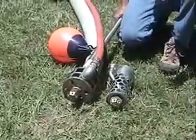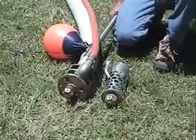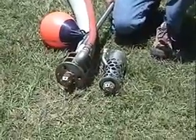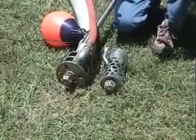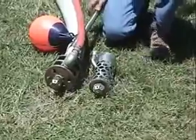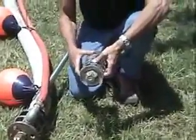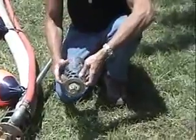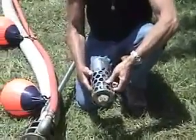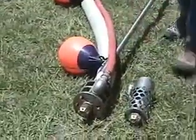And if it's a hard object like a chunk of wood or rock or a piece of metal, it could jam the impeller on the pump and stop the engine, and you have a lot of energy there that is stopped all at once and something can fracture. So it is recommended that you use this head if at all possible. Now there are some circumstances where this head may not work for you, and we're in one of those situations here today.